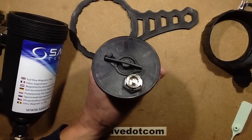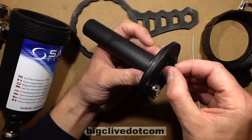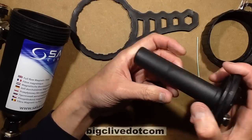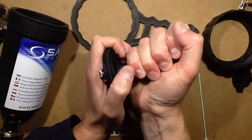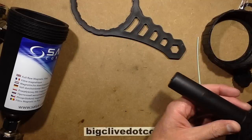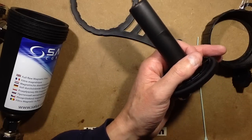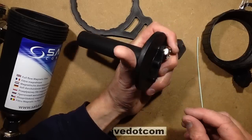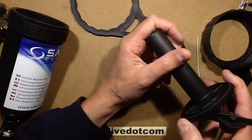There's a seal that's obviously designed to go through here. If a kid or curious adult found this, they'd pull out the big neodymium iron boron magnet. The water flows around it and all the metal — steel — particles stick onto this magnet, and you end up with a black, jelly-like sludge buildup. The idea is you're supposed to take it out, release the seal, and pull the magnet out. As you pull it out, all the sludge follows the magnet up and then drops off, so you can rinse it under a tap and put the magnet back in. The seal ultimately stops inquisitive people from pulling the magnet out while it's in situ and suddenly releasing all the gathered sludge back into the heating system — not a very good result.